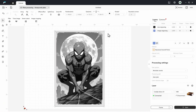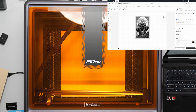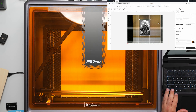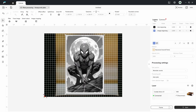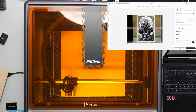I have a few options. This is probably a little too big so I'm going to make it smaller. If you click on Camera and take a photo — below the top cover there's a camera, and this is what you use to take pictures of what you're going to laser engrave on. It'll show you the background and then you can zoom out by holding Control. This helps me kind of focus it and position the image. I'm going to center that, click Frame, and make sure the laser is within the frame.